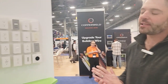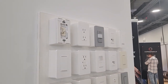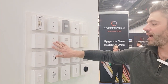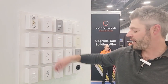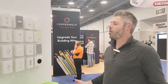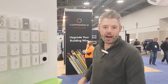Starting off with our wiring devices here. Our X-Series wiring devices are great for a number of reasons — first, for retrofit applications as well as new home construction. What's great about these screwless plates and designs is that you're able to actually remove the toggle switch and the plate itself and then change colors. So if you decide to retrofit the home, paint the walls, and want to change up the feel and the look, you can actually do that at home yourself without having to rewire the entire device.